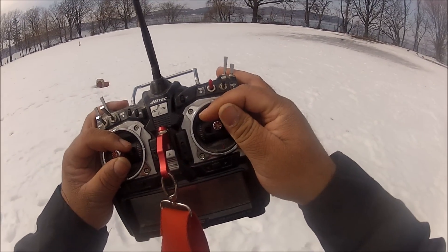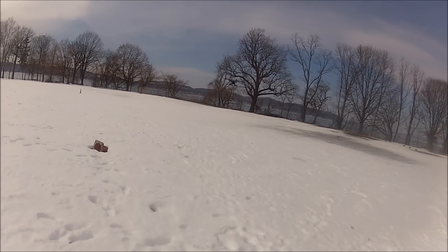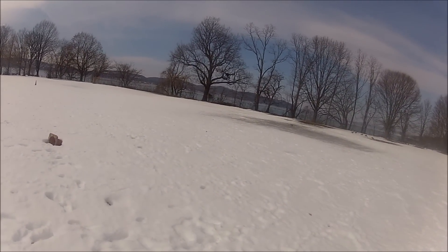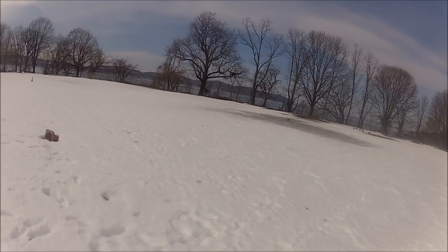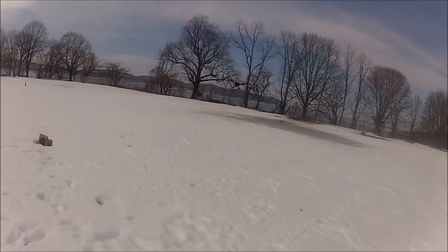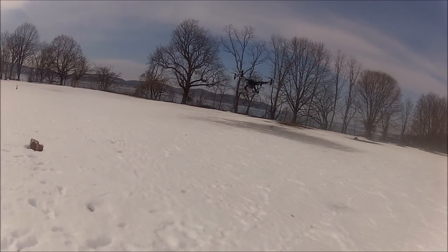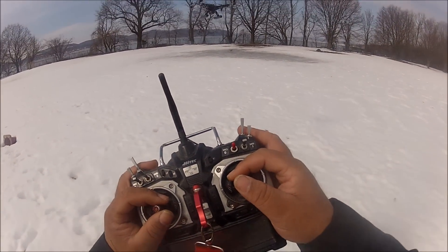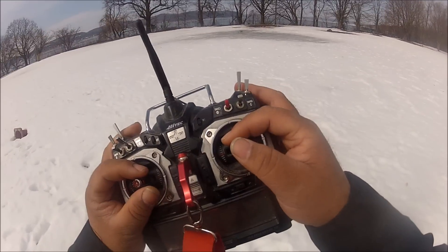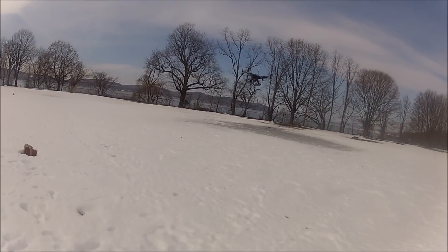Right now I'm about to reach 19 minutes of flying time and I'm impressed. This aircraft right now, even without the FPV equipment, is heavier than my F-550. My F-550 weighs with all the FPV equipment around 2,300 grams, and this one weighs almost 2,500 grams — over five pounds as-is. And it's giving me about the same flying time that I accomplish with my F-550 with all the FPV equipment installed, and it's heavier. Having eight motors with the props I got seems like a more efficient way of flying than the hexacopter.